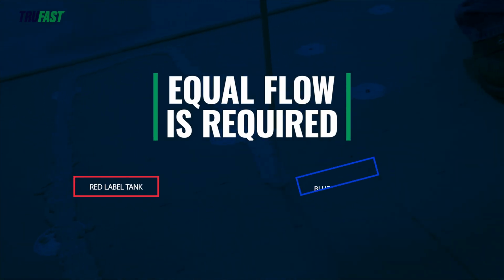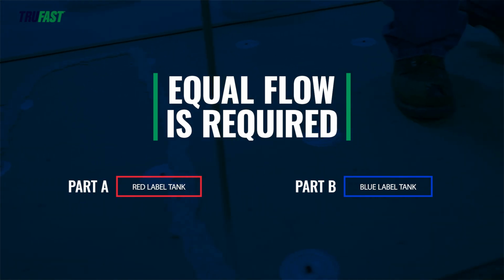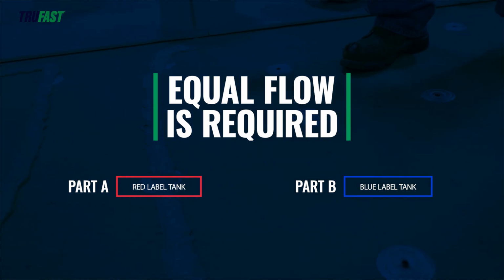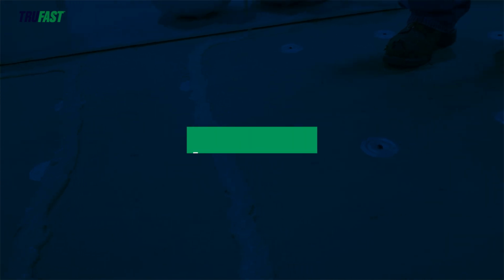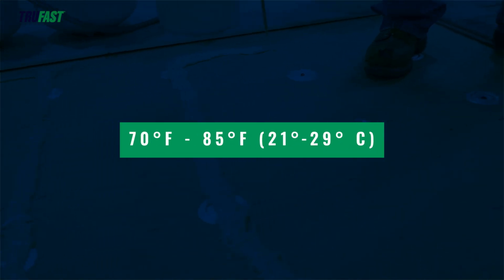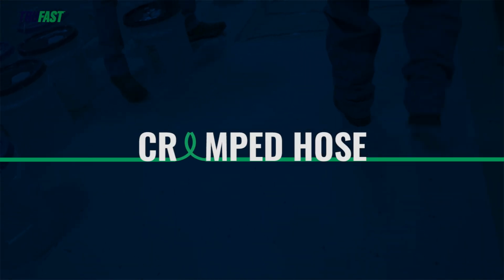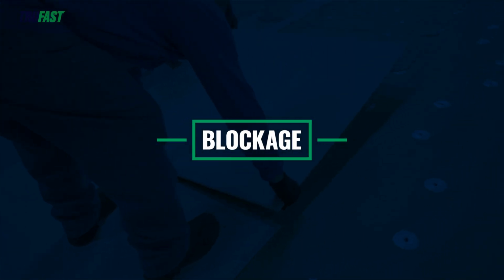Equal flow of both tanks, Part A and Part B, is required when using this low-rise adhesive system. To optimize foam yield, curing time, and proper performance, maintain a chemical temperature between 70 degrees Fahrenheit and 85 degrees Fahrenheit. If problems occur, the cause is typically due to a pinched or crimped hose or the chemical temperature creating uneven flow or blockage of one of the chemicals.